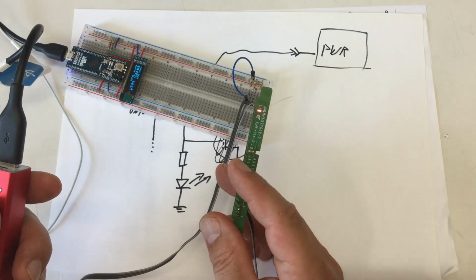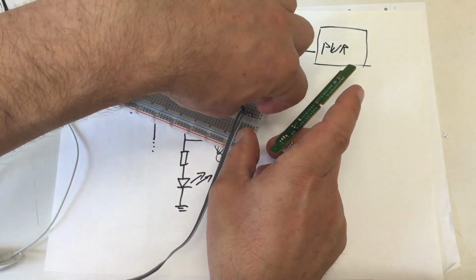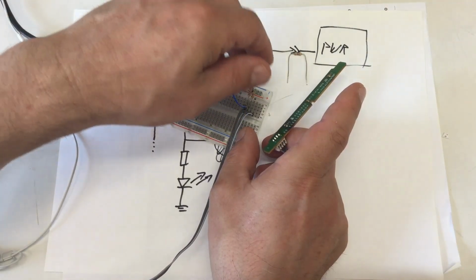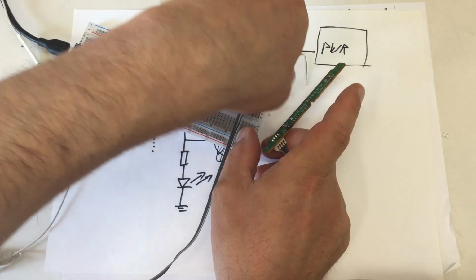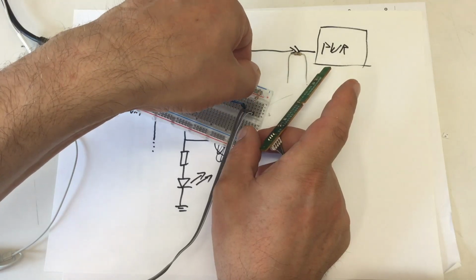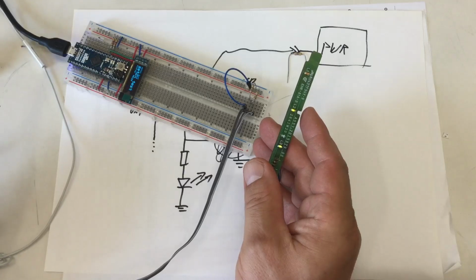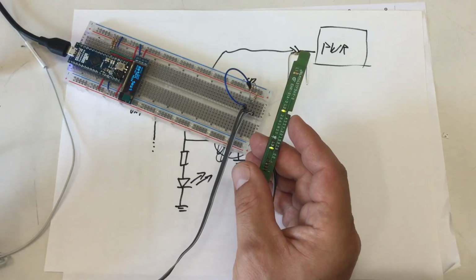Maybe they are the right way in, but I killed them. Let's test that. I take the resistor for the red LED out, and blue is now red, so I put this on the positive rail. And the resistors go back to the negative rail, ground, whatever your flavor is, and okay. So yeah, wrong way around.